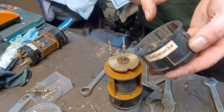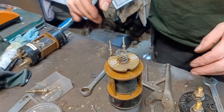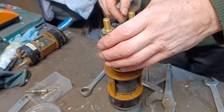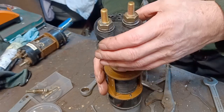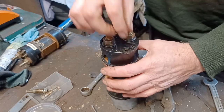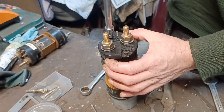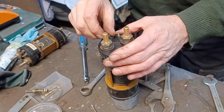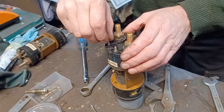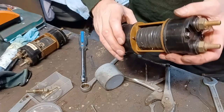With the new contact points in the top and the new contact plates in there, you need to remember to put the spring - that's what the little washers are for. The top is assembled over the drive pins, over these two holes, and the whole lot is dropped down. If it lines up properly it should come through quite nicely, and then these are tightened down. These little nuts I just put on to hold them steady. And that should be one contactor complete.